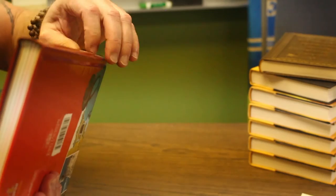Lastly, I'll show you this last form of special case binding. It's a specification used primarily in education books — Elhi books. This is referred to as Nasta, N-A-S-T-A. The difference here is it's sewn, and it has a reinforcement in the first signature and the last signature for extra durability for kids in school. And then it has what's called a tight back spine, which means there's glue from head to foot and the cover is snug right up against that book for a really super strong bind. That's a Nasta book.